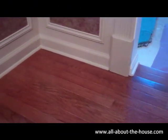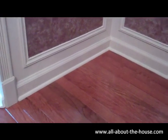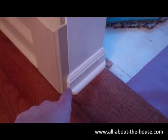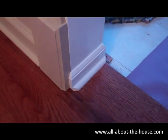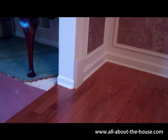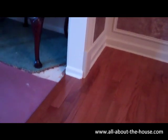You can't underestimate how much time this final trim work is going to take. I actually had to remove the plinth block and shave it down a little bit on the bottom. The entrance way into the next room — this white molding piece I had to remove and customize, and I chamfered the bottom of that cap molding. Small little details, but they take a long time. Frankly, if you don't do them it doesn't look good; if you do them, people don't notice — but if you don't do them, it's over.